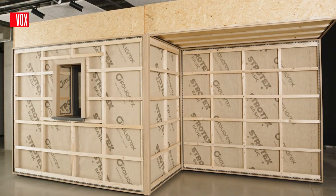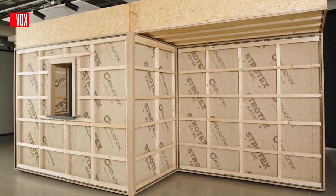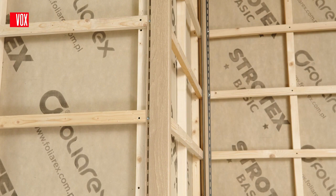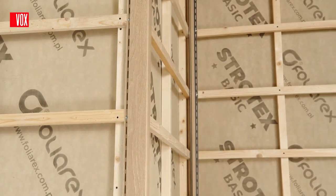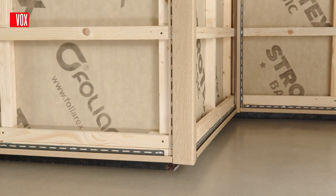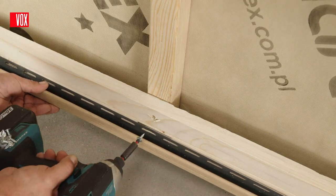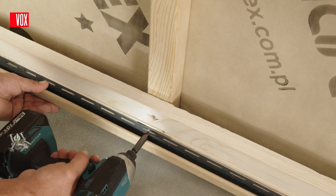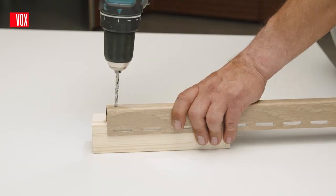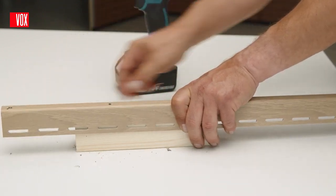For vertical installation, the Fronto panels are fixed to horizontal profiles, or as in our case, to wooden substructure battens. Before starting to install the panels, level and screw on the trims. The SV11 starting trim at the bottom of the wall is not used for vertical installation. This is replaced by the SV15 trim, in which several holes must be drilled for water drainage.